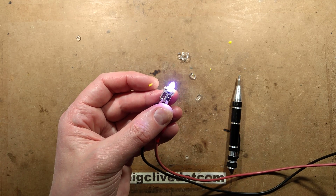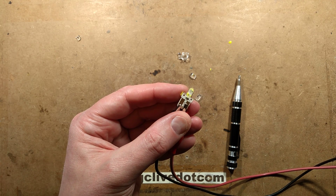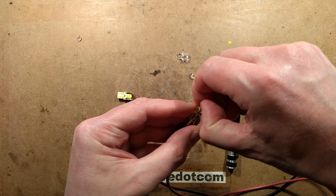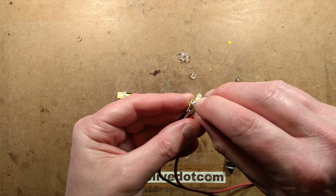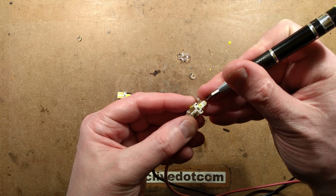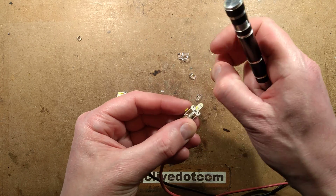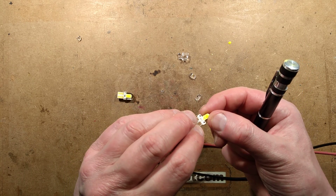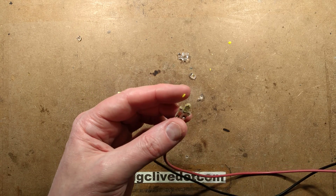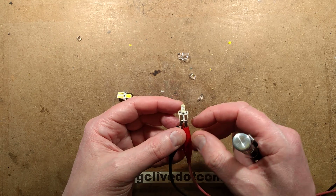I was thinking it might be blue LEDs underneath the phosphor, but that is really distinctly violet LEDs. I'm going to have to turn the light off now so I can actually see what I'm doing. I can't see a thing — I've been looking at an LED. What I'm going to do is expose this completely, then take pictures and analyze it. I've got most of the phosphor off one side; the other side still has it on. Let's light it again and see if it works... I've just killed it. I must have knocked one of the chips off.